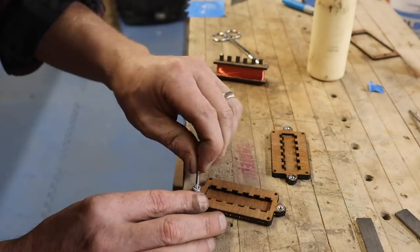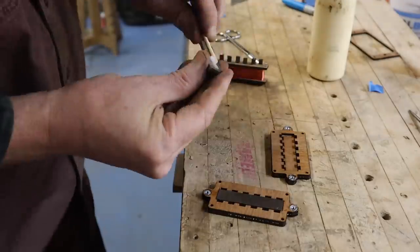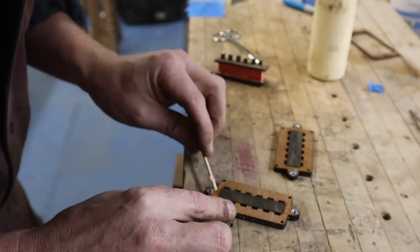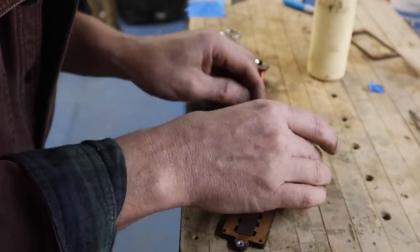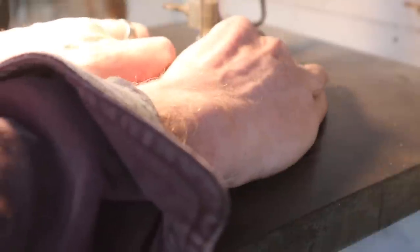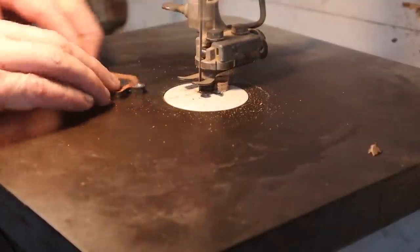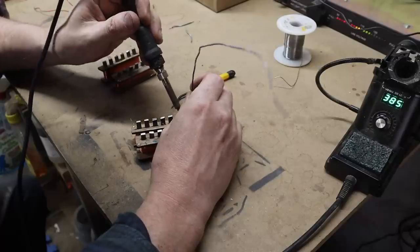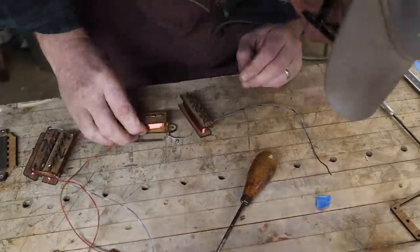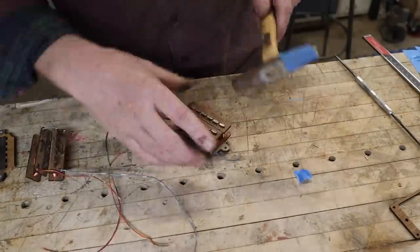I'm epoxying in nuts that I can thread screws into, sandwiching them together to get all the pressures right. In the future I might get actual metal plates made that I can tap so the threads go right in, but I have to finalize the design. I also realized I'd previously designed a piece with corners cut off to make room for the wires, so I just had to cut that off by hand — I'll rectify that in future versions. With everything wound, I was ready to assemble and put all the pieces together.